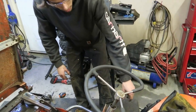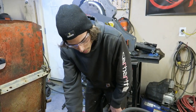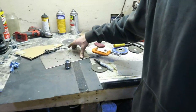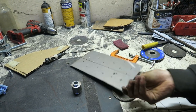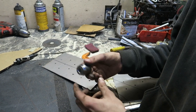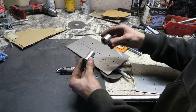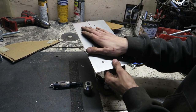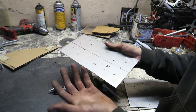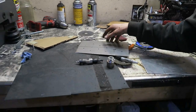While I was working, Tony's been cutting out cardboard templates and metal to make the running boards. We're making them out of three sheet metal pieces. I made this simple dimple die — a nicely laid-out piece — and we're going to hole-saw it out with our hole saw set, throw it in the press, dimple-die through the metal, and have nice foot running boards with a bit of grip.